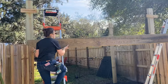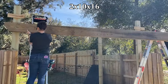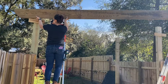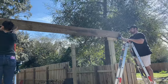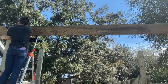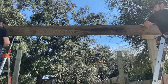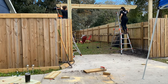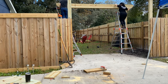Now it's the fun part. These are two by ten by sixteen foot pieces of lumber — we cut them down a little bit to the right length, wanting about fifteen inches to stick out past the posts on each end. You can see there are scrap pieces of two by four on the posts — those are just to make it easy so we can set the beams up there and have them stable while we screw them in. That is what we did with all four beams. There is one beam on each side of both sets of posts.